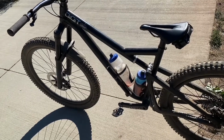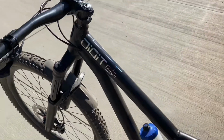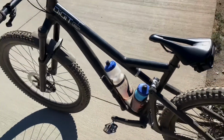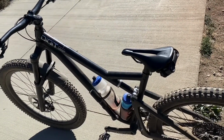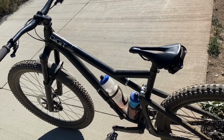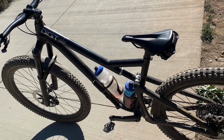On this one, the welds are a little bit pudgy, and it has some issues. For instance, you'll see that the stickers on my prototype here are coming off. This frame is painted with about 4 layers of barbecue paint, which is why it looks kind of scratched up. Production is going to be anodized. Anodized is going to be about half a pound lighter than paint. Probably about 1 pound lighter than this one, because this one has an enormous amount of Bondo built into it to smooth out some of the problems from me hacking this thing together. Literally, this thing has a couple of layers of Bondo and some JB Weld holding some of the parts together.